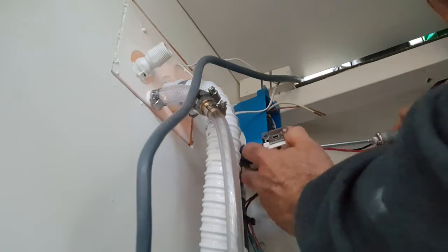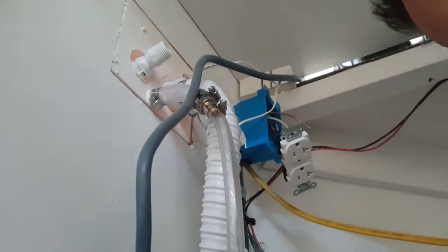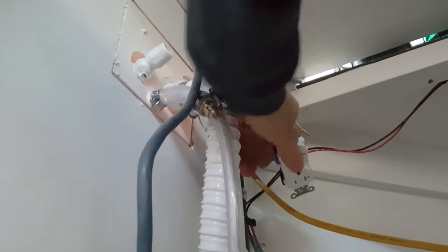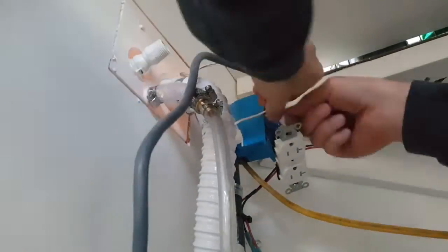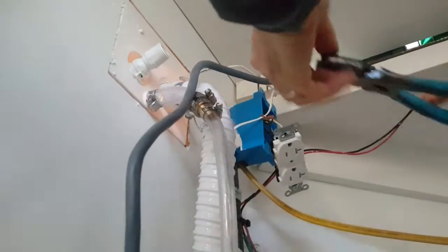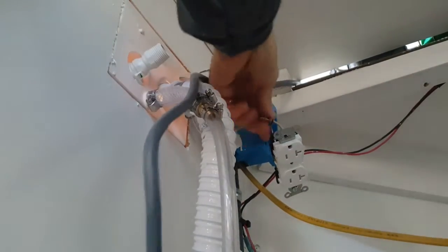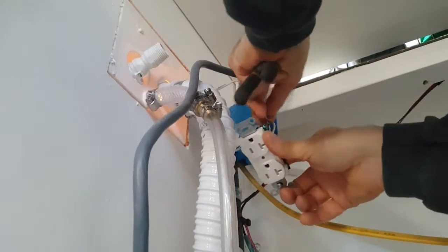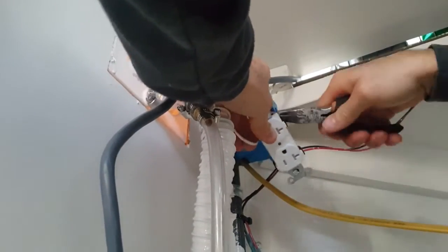You've got to do the same thing with the silver and the white. What I'm going to do is take this hook loose and twist these wires together and put that hook back on — that's going to be easier than trying to put two hooks on that one screw. I'm going to cut this off right here so that the bar is not sticking out, then reform my hook. With the thicker copper wire it's tougher to handle, but now we've got it.